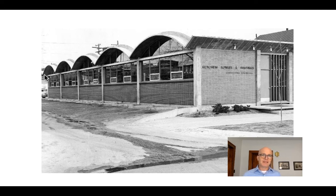That is basically a tension rod covered in concrete, assisting the stiffening beams in making the vault keep its shape. You can also see collar beams over the top, holding onto the vault and making it maintain its curvature even though it wants to flatten out and fail.